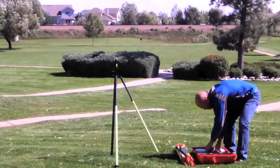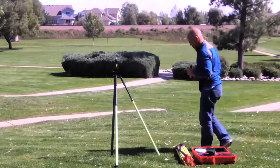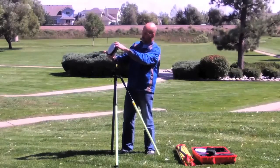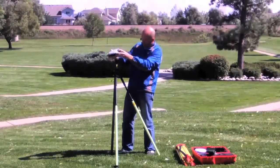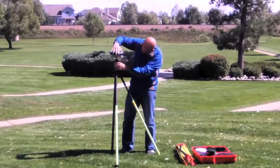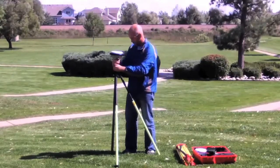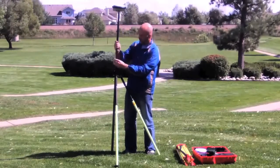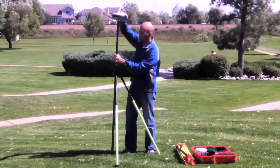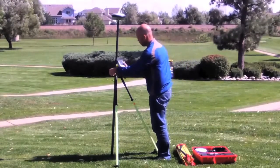Now we are going to take that GS-14 system out to the field and do some work. To start with we are going to set up a network rover. We are going to use a single GS-14 antenna and connect to a GSM network to receive RTK corrections from an RTK network available in the area. For this I need the data collector and one of the two antennas. Simply put the antenna on a pole and power it up. The GPS receiver will start tracking automatically and we will use the GSM connection in the controller, though we could alternatively use the one in the antenna. We are going to get a correction from the local network and apply it.